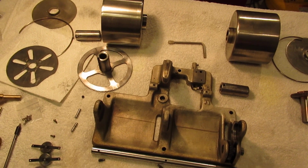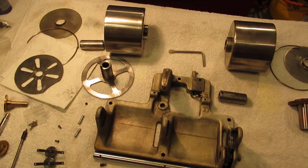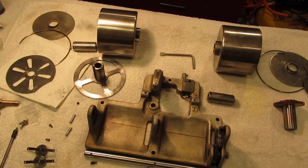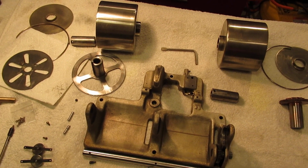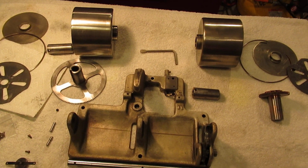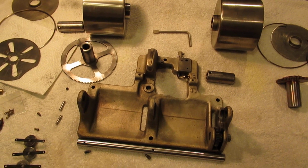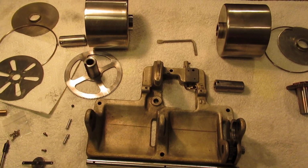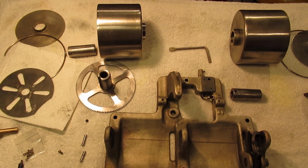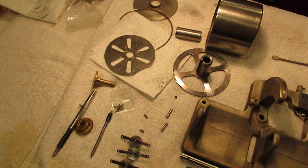But at the same time, before I took it apart and cleaned it, I cranked it up in the machine quite often, and it ran great. It just played and played and played, record upon record upon record. There was no problem. And the springs in these spring barrels, at the bottom of each spring barrel, was like concrete. I've never, ever worked on a motor before with that much petrified concrete grease. It was original graphite, and the springs are original Victrola HMV springs.